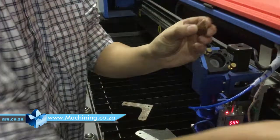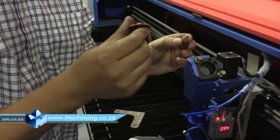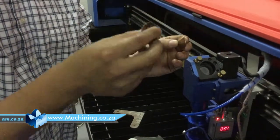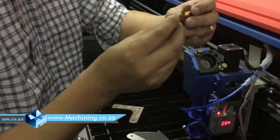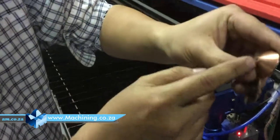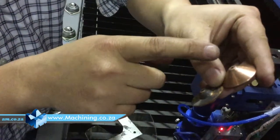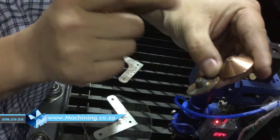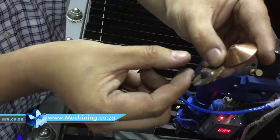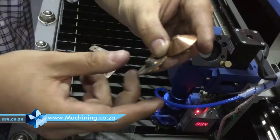It's the metal cutting one. And this other one is for cutting perspex, wood, or non-metal. You can also use it for aluminium. They are basically put in the same way. This metal cutting one just maintains the distance closer to the metal, so you can have the oxygen in a more concentrated area. The other one has more distance for the smoke to go out when you're cutting non-metal.